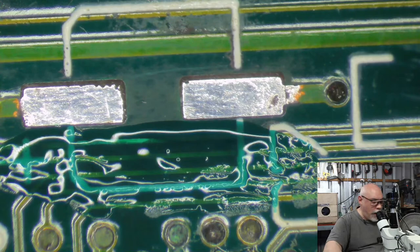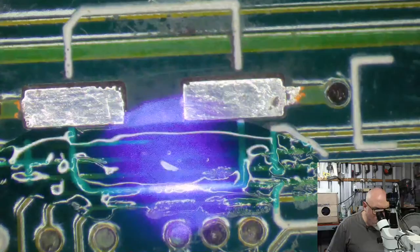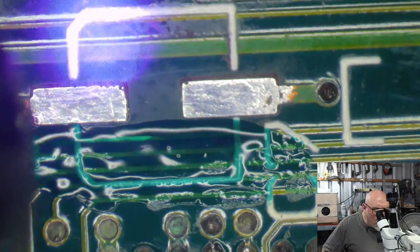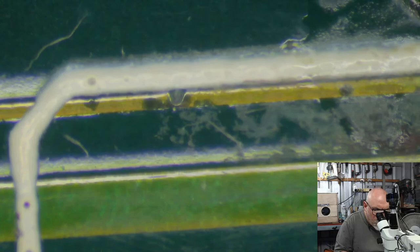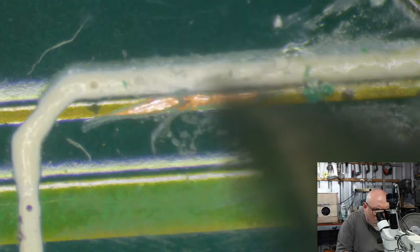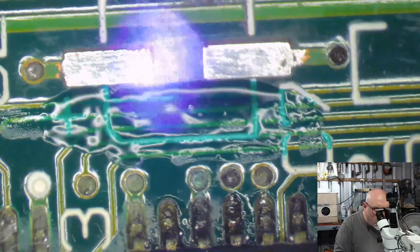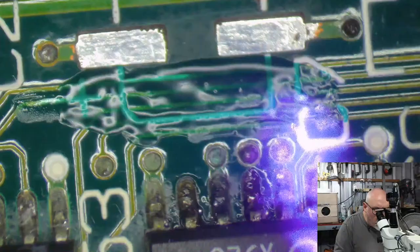Okay, I am going to paint the bejesus out of this board when I'm finished with this UV solder mask. But for now, I'm just painting the parts that are going to impact on the components that I'm putting on. What's that? Is that just a dot on top? You can't see it. Yep, just a dot on top. Copper's still fine. So once this all gets cleaned, it's going to have to be painted. I mean, look at some of these. There could be a million and one busted traces with these as well. We'll cross that bridge when we come to it.